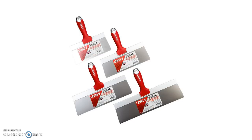When it comes to finishing, there are different size knives. Usually on your first coat, you start off with a smaller size knife for the screw holes and the joints. Then as you proceed to your second and third coats, you use a larger knife. This allows you to float the mud out, which allows the wall to end up being a lot more smooth. If you only put on one coat with a narrow knife, there'd just be a big bulge where the joint is, and you would see it once the wall gets painted. A larger knife allows you to float the mud out more, and once you sand, it will hide the joint really well.